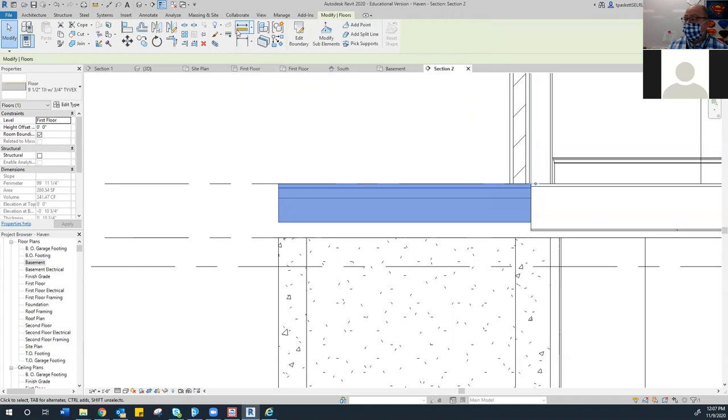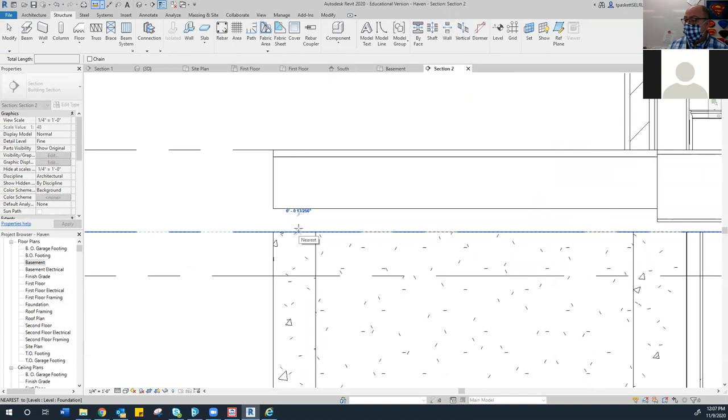So I'm going to measure from the top of the foundation to the bottom of my framing, and I'm getting 4 1/4. Is that what you guys are getting? Okay. So now we have to get out a calculator. And if you don't have calculators, pull your phones out. You must have used them anyway. Go to your calculator setting, and then take 4.25 and then minus 1.5 from that. And you should get what?